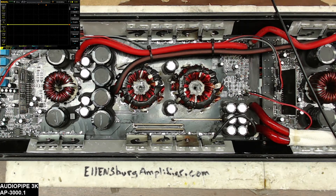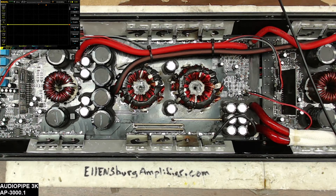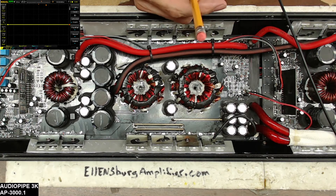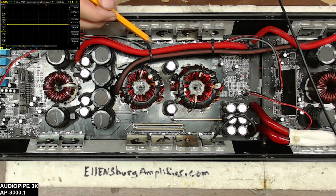That would be the reason why the frequency is off on this card — R710 needs to be a 10k resistor. It's just strange; you can't find this every day on amplifiers, where there's something lingering like this with the wrong value in a location. This clearly explains to me why this amplifier failed originally. I do believe I have a video on this board — I'll link it. I had to do a massive amount of repair on the PCB because it really burnt the traces up pretty bad, which makes sense because the frequency on the output was wrong.